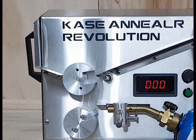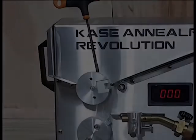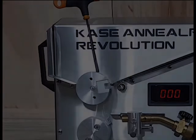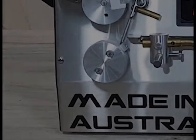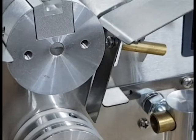Turn the machine on and rotate the top wheel until the cutout is facing 3 o'clock. Place the case insert into the cutout slot. Using the 3mm Allen key, insert it into the hole at the top of the wheel and tighten snugly. Screw on the wheel extension, if needed, with the 2 supplied screws, with a Phillips head screwdriver. Insert the case guide on the rod.